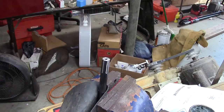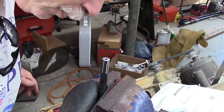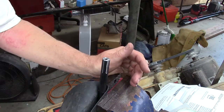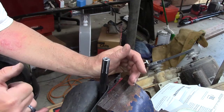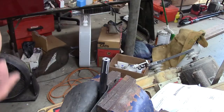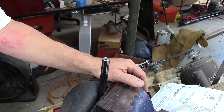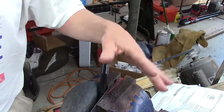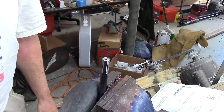Okay. So now pick up and put away these tools. And then we'll put it on the bench, clean the bore, blue and oil, mount the muzzle brake, get the action mounted in its new stock, yay, and I'm going to have to cut the forearm bolt to fit, and then once that's done we'll be test firing it. So I'll check back in with you in a little bit. I'm really glad I did this. The gun's really going to benefit from having had this done. Okay, we'll check back in with you in a bit.